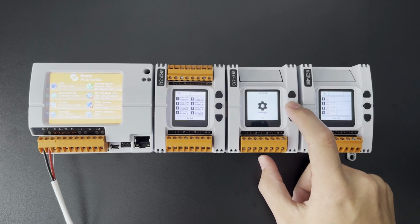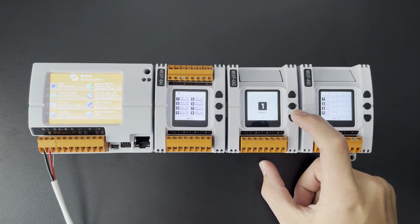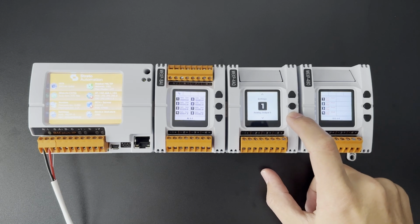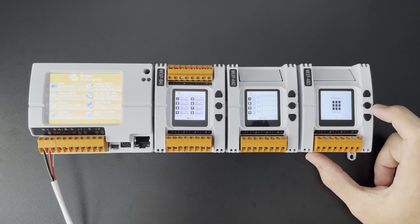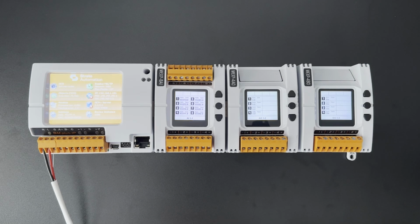On this 4AO unit, up to the settings, hit up, center to get into the menu, address, click through until it asks me which row. 1, so that's fine. And then this is the second unit, so it's column 2. And then I'll go back to the information display menu, and I'll do the same thing for this 4BO unit. I'll go up, center, settings, address, row 1 still. However, this is now column 3. Hit apply, and then I'll go back to the settings, the information display menu.